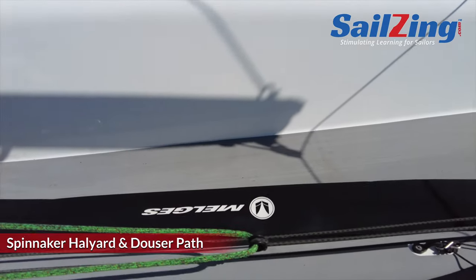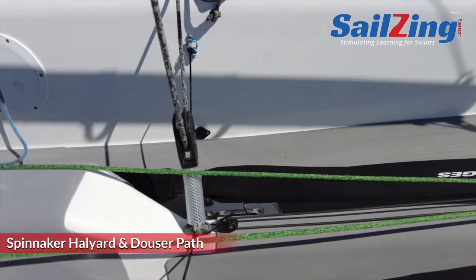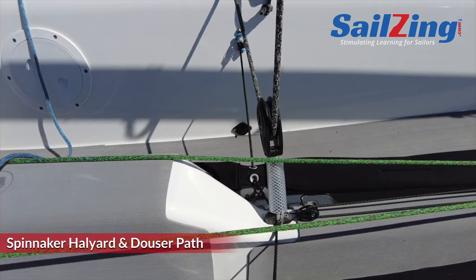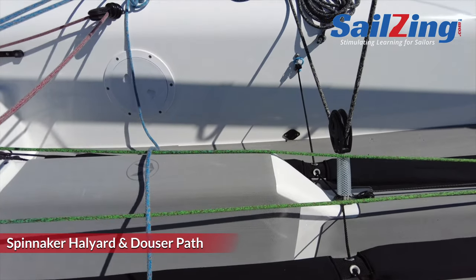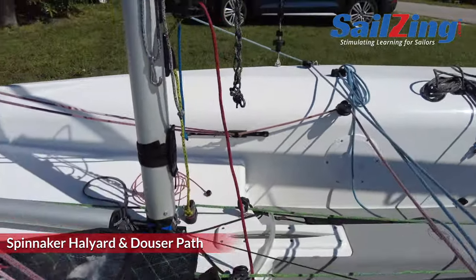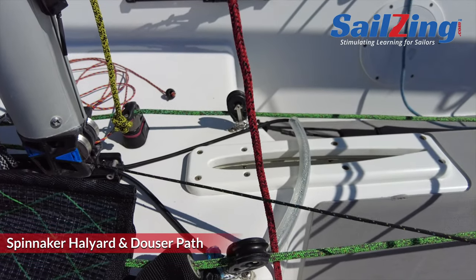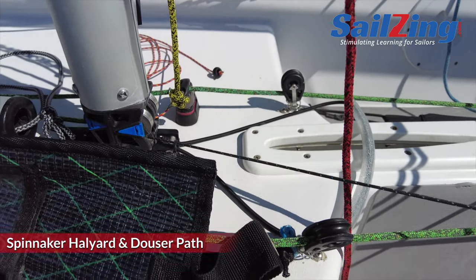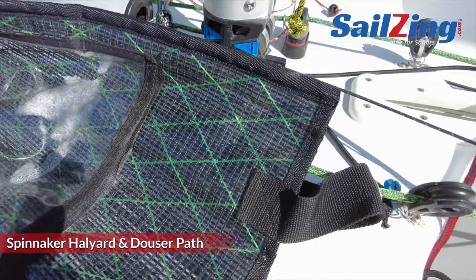And now we'll follow it forward, so you can see it come out of that eye. You can see that both sides of the spinnaker line, halyard, come up on this side of the block. It goes under everything else. You want it under your jib sheet, your spinnaker sheets, everything else. That red is the vang. Ignore that, because that will go wherever we want it. It goes through this block up to the dousing sock, if you will.